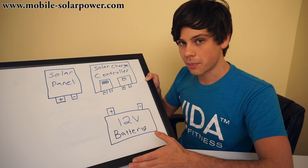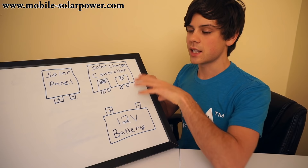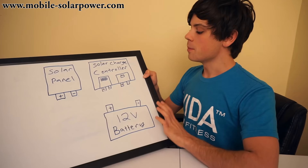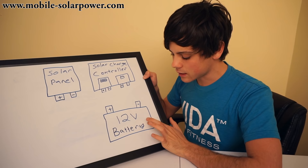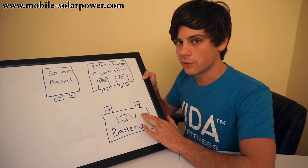All the other things feed into it or take things out, but the battery is the one thing that you should focus on the most. A lot of people see the solar panel and think, oh, it makes electricity, and then they go to the solar charge controller's tabs for small appliances. No, you don't want to do that. You connect appliances to the 12-volt battery. The fuse blocks and everything else come to the 12-volt battery. You charge it with a solar panel.